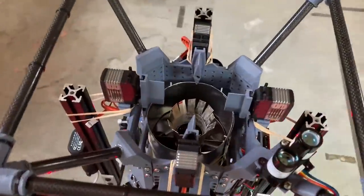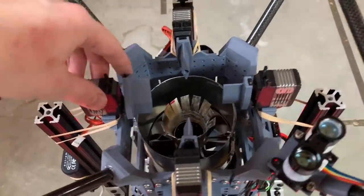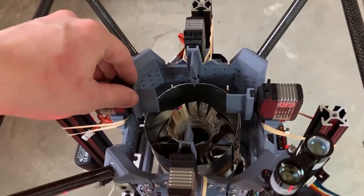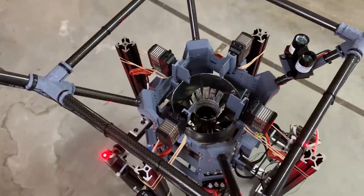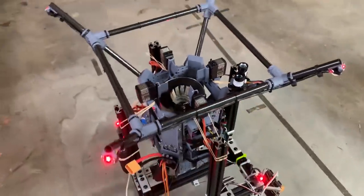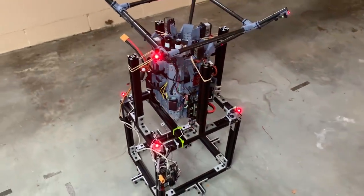The vehicle is controlled in yaw, pitch, and roll with thrust vanes. These are 3D printed right now, but they'll be CNC cut out of aluminum or maybe graphite as things go forward, because we're also going to be tossing a bunch of butane out the back so that we can get a nice flame as this thing is moving through the air.